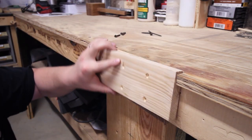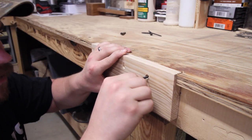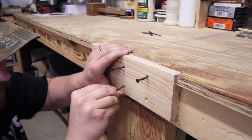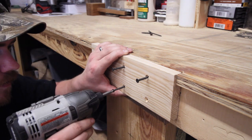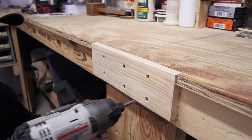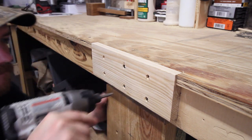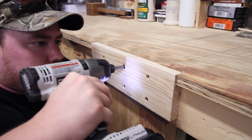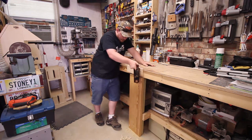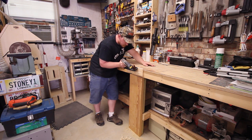Here you can see why the top needed to be notched out — that's for the rear jaw of the vise. It's going to be secured to the workbench with six screws, and I'm hoping that whatever shape the structure is behind it, this piece of 1x4 pine takes on that shape. I want it to twist and contort as needed, because that tells me it's a solid connection. The screw heads are countersunk below the surface by quite a bit so that if it does twist — which it did — I can come back with a hand plane and plane the surface nice and flat, ensuring a consistent solid connection throughout the clamping area.